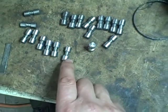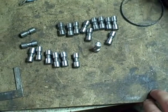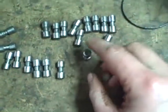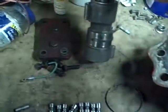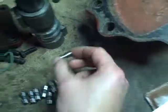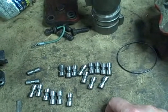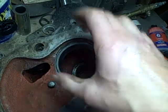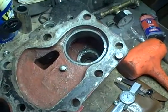I've checked the OD on the contact surfaces of every one of my old main rollers and it's okay - I kind of figured it would be since that was drill stock and it was the right OD. I then checked every single one by sitting it on the little clip ridge to make sure there was enough clearance underneath, because that's what I thought was going on before, but that's not the case. If this were out of round, I would expect it to bind all the way around, not just in one spot.